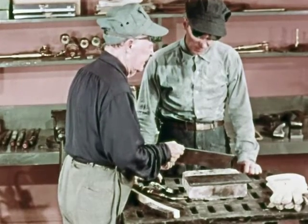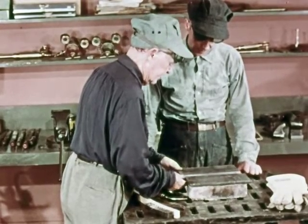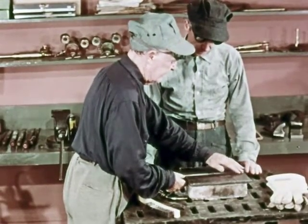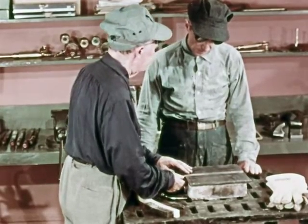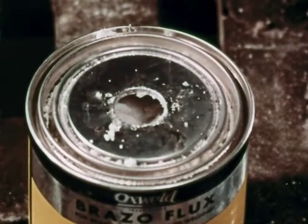That's enough for today's lesson. Let's review the important points you've learned. Rust, oil, and dirt must be removed from the area to be welded to permit proper tinning. Bevel the edges of the metal when it is more than one-eighth of an inch thick. If you don't have a flux-covered rod, use plenty of flux so that the metal being welded will be chemically clean. Tin the weld area carefully — you can tell when you've got the proper heat because the bronze flows smoothly and evenly. Keep the flame and rod in motion. Remelt deposited bronze when making additional passes in thicker metal. Learn to control the puddle and spend some time practicing.